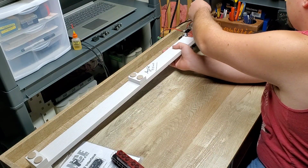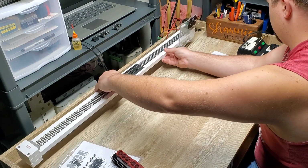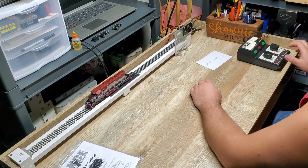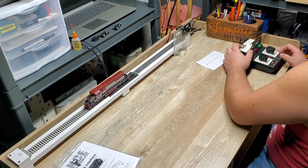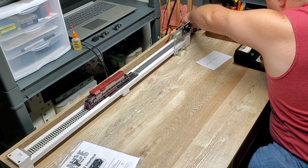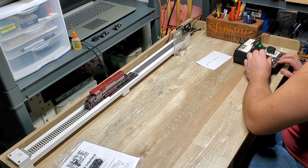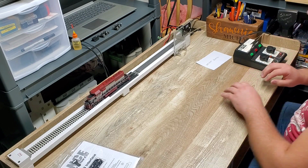So we've got our DC power wires here going into this side of the switch. What it could be is that the switch is actually reversed compared to what we're seeing. So before we get too far, let's check that real quick. So something's happening to the system as it's set up, because when I power this up now, there's nothing. So there's something wrong in the circuit.